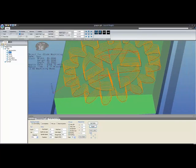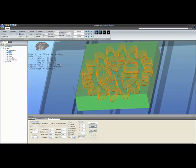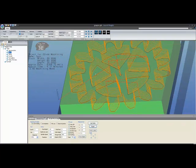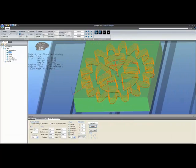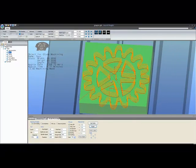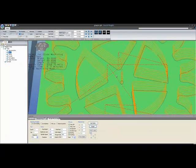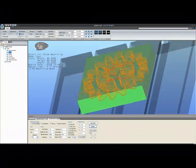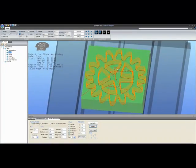Set your spindle speed, set your feed rate. The system will give you an approximate machining time and tell you the full length of the path. That will be tweaked over time. Incidentally, on bugs, you will probably find a million things in here which act strange or allow you to make impossible tool paths. We'll tighten this up, obviously, as time goes by, but for an initial release, you'll find that you haven't been limited very much, and you can do some pretty strange things in here.